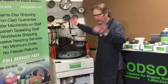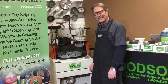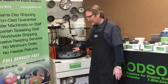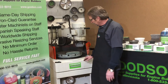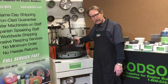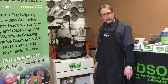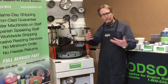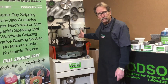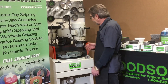Let's face it, they're dirty machines — they grind, they make a lot of noise, they have coolant flying around, and you've got dresser debris flying all over. That doesn't mean you don't want to maintain them. You still need to keep the inside of the reservoir nice and clean and wiped down, keep your coolant fresh, keep your dresser functioning correctly — rotating, with good sharp edges. There's also a lead screw adjustment in the back of the machine that needs to be periodically checked and maintained. Check your instruction manual for your particular machine and it'll walk you through that procedure.